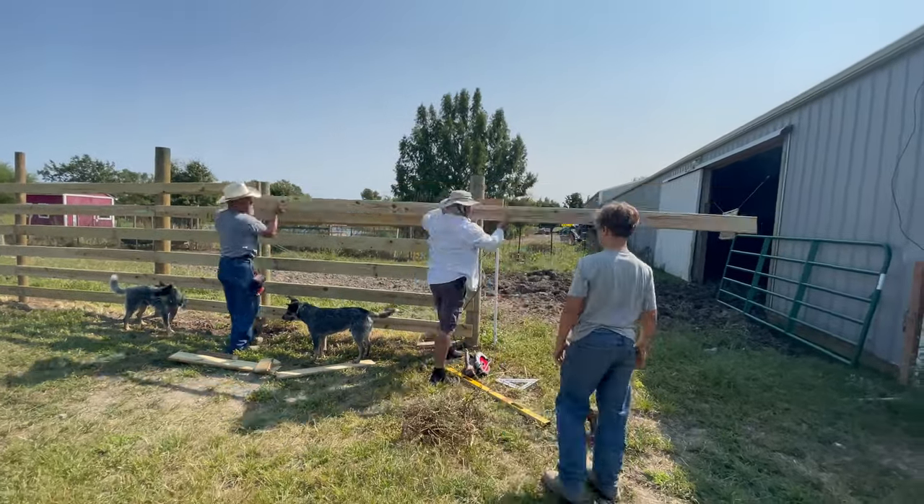Now we're building the inside of the two alleys, built about 16-foot width, or 16-foot gates. When I build, that means I make it about 16 foot 4 — I can always add a 2x4 in there when I hang the gate. A 16-foot farm gate you typically buy is set for a 16-foot opening, so the gate's a little bit smaller. We wanted to make sure we had a couple of inches left over no matter what, because a couple of these gates are going to swing more than one direction — so it can close off one alley or the other.